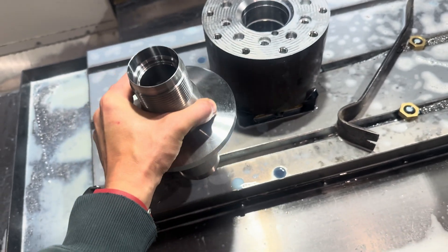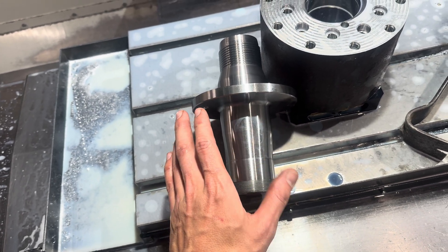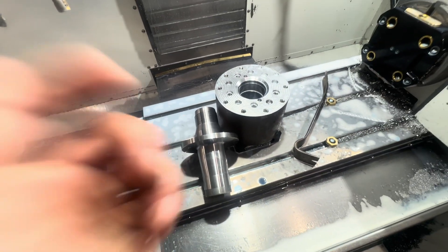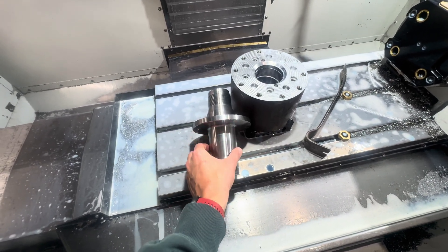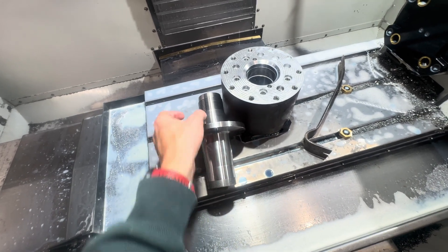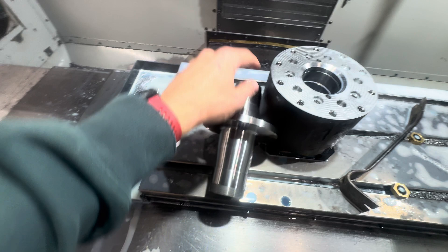The good news is it's actually a setter piece, which means a couple of the tolerances are slightly out. This one here, which interfaces with that, is actually six microns over, but it's okay for the tolerances over the whole system. I can do this to an H7K6 fit and this will still be tight going in, and I know the other ones will be all good. I also struggle to measure six microns, so we're all right really.